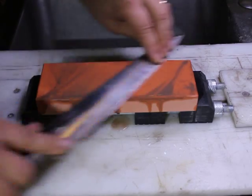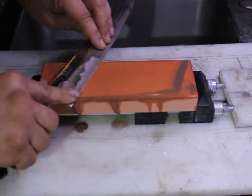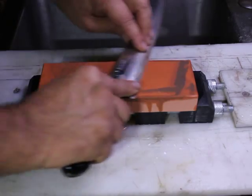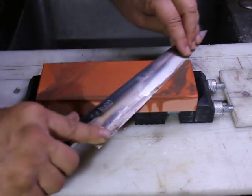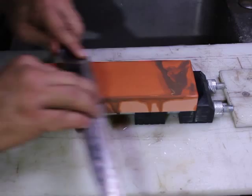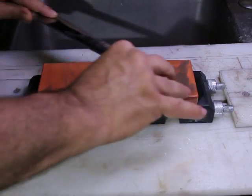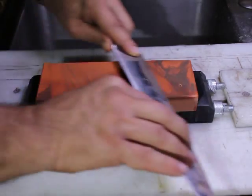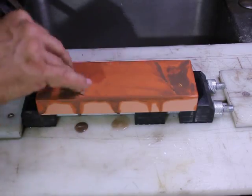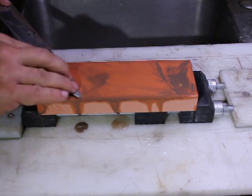Keep feeling like I'm almost done with it, but then every time I feel it, it keeps getting a little bit sharper. I think that's an interesting skill to develop, to get a sense of touch for sharpness. This is particularly useful for feeling that extra bump in sharpness that one gets preceding burr formation. So you can see I'm letting the mud get kind of thick here. Not adding a lot of water to it at all.